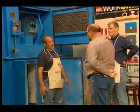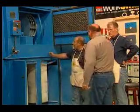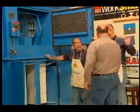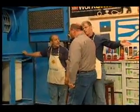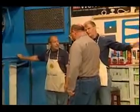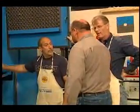It's kind of one of those things where we're filtering the dust before it gets up there. So you should never have a problem. But that's another thing that's important to point out about these tables too, is the explosive potential of wood dust. This diminishes that possibility greatly by pulling it down, getting it out of the air, so you can actually avoid that whole problem in a shop also.